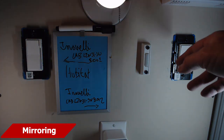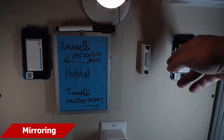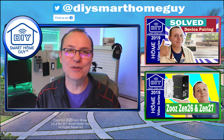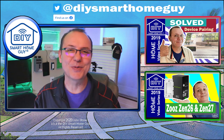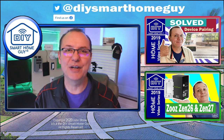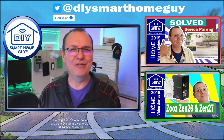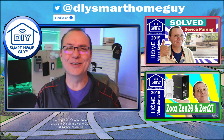Again, this will perform differently from switch to switch and from hub to hub. You're going to want to test this out and see how it goes, but the safest option is always going to be sticking with scene control. And if you're wondering, hey John, can I use a smart on-off switch to control the dimmer? Well, you're in luck — the answer is yes. And since I recommend using scene control, your best bet is to do it this way anyway. Just set up the on-off switch with the same multi-tap features that I used in this video for the secondary dimmer switch. Do that and you're all set.